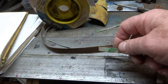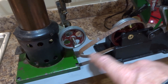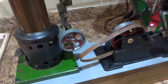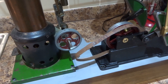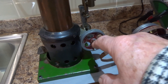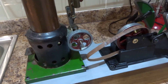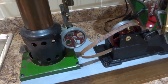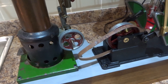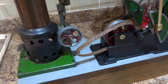So I've glued together a length of the 400-grit, using the grit side down at this stage, although clearly you could turn it over if you wanted to. The plan is to make a pulley of such a diameter to put the correct tension on this belt, because I don't really want to have some sort of tensioning arrangement, and it isn't going to get a lot of running. So the next step is to make a little pulley.